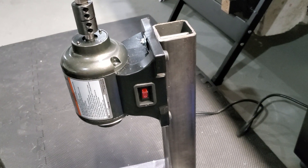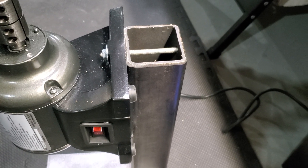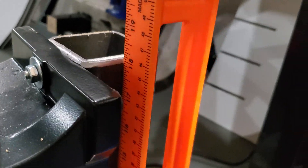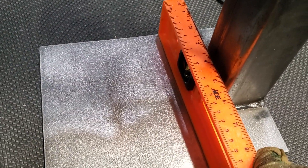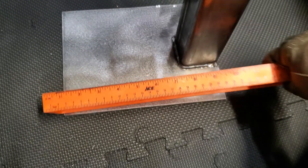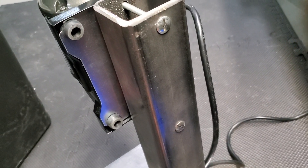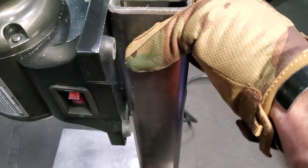What I've got is a two and a half by two and a half inch square tube with a quarter inch wall, at 18 inches tall, going down to a quarter inch plate — eight inches across and roughly ten inches in length. I've got two holes drilled back here — I did three eighths on this side and five sixteenths on this side, with a quarter inch bolt all the way through.